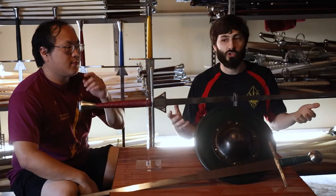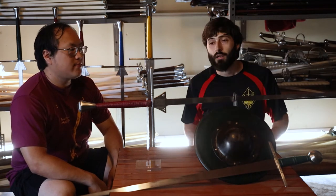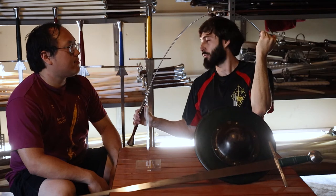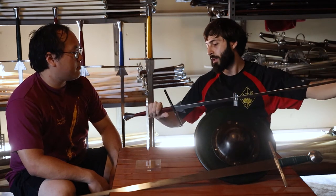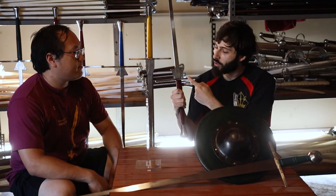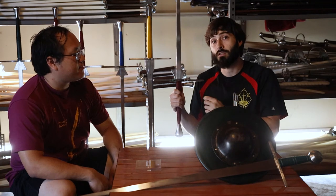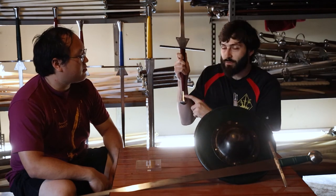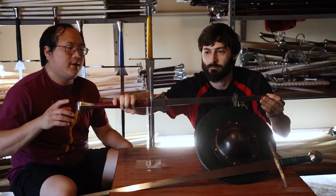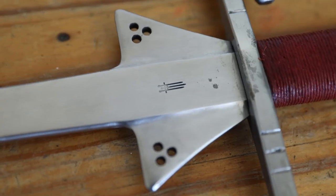When we got these, my first impressions were that they felt nice and looked nice. We've got to do a little bit of sparring now and the blades have held up well. I'm fairly impressed with the flexibility — they've got a very comfortable amount of flex and they come back true each time. The only downsides so far are two small issues: the grind lines on the hilt seem to have multiple plunges with inconsistencies in the grinds, and the same with wherever there are faceted pommel lines — you can see some wavering; they're not nice and straight. Another thing is the inconsistency of their stamps — some are off-center or kind of half faded, like they didn't stamp all the way, so the maker's marks are not always deep and beautiful.